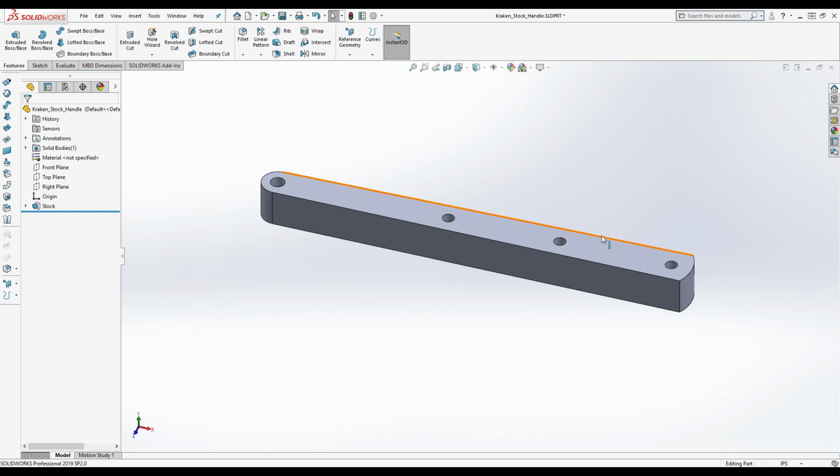But it's interesting because I haven't actually really done this. Okay. So I don't have a micrometer for the blade. But if you've got a blade that is 0.125, which this one is, and you have bushings on that blade, you want about 1.5 thou of clearance. But that's not on both sides, that's overall, okay? So you would want 0.1265 bushings, right? So that takes up 1.5 thou of that clearance. Another 1.5 thou makes sense, okay? So we're going to roll with what the calipers tell us on this one.